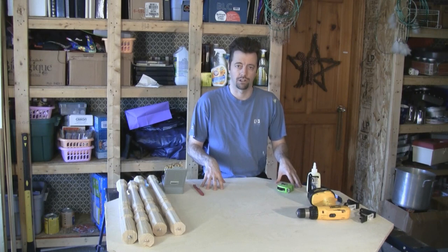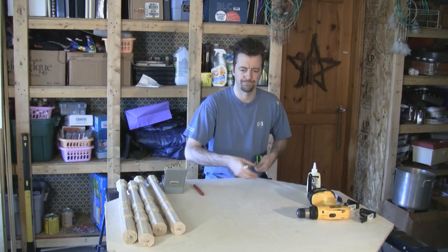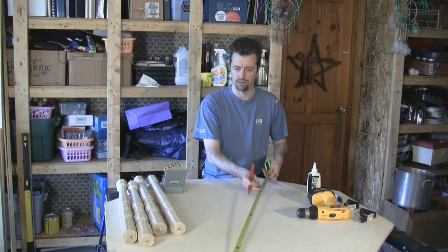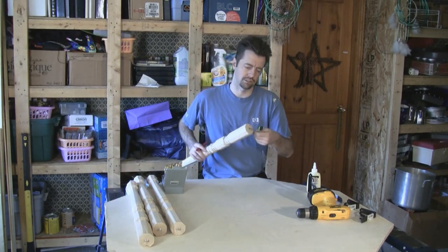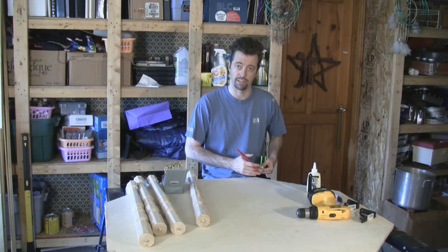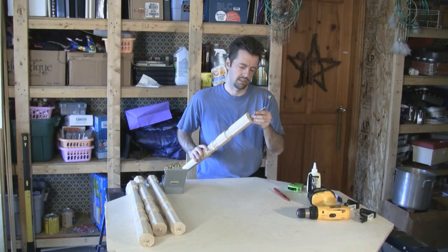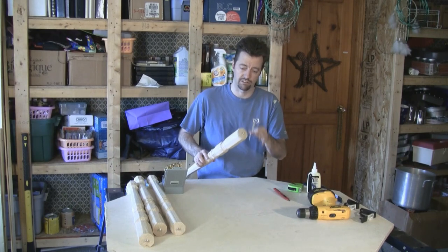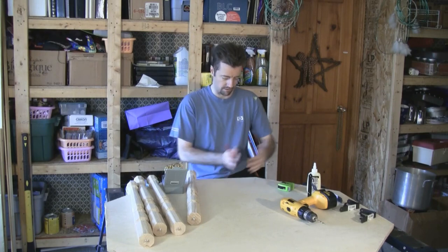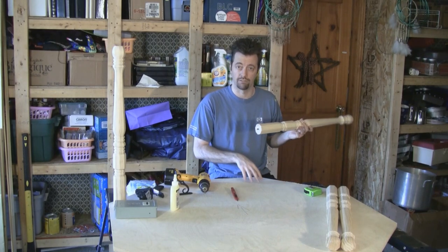The middle that we cut out of the large octagon will be recycled into the base for the table — this is what we'll attach the legs to. I'm going to start by drawing a line from corner to corner, just to give me a spot to mark the center for my table leg. These table legs come with a screw on the center to insert them and that screw's about an inch in from the leg, so I'm going to mark my center point two inches in — that'll give me an inch of room on the edge of the table from the leg. I'm going to drill a pilot hole with a bit that's just a little smaller than the shaft of the screw point so it'll be a snug fit. I'm going corner to corner so that when I'm seated at the poker table I don't have a table leg in front of me, I've got it off to one side. I'll always do a dry fit first so that the threads are already cut in the wood for when I'm ready to glue the leg to the table.